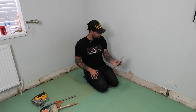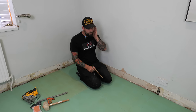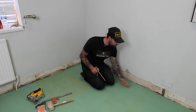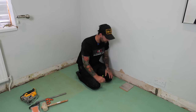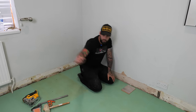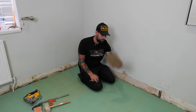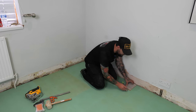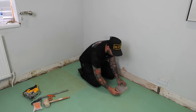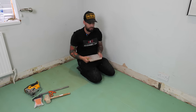We're ready to finally lay some flooring. You'll need to decide which way you want it to run - we like to run it along the longest run in the room, but there's no strict rule. You also need to check you don't end up with a tiny cut on either side. The easiest way is to take an offcut of your flooring, leave your 10mm expansion gap against one wall and start marking across your floor until you get to the other side. If the cut is too small, adjust your starting plank.